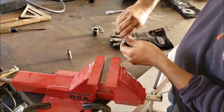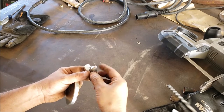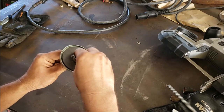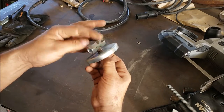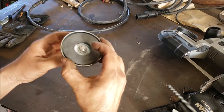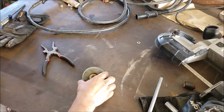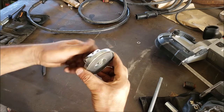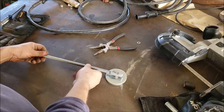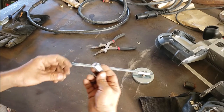We're gonna assemble this — put a washer on the top side and another washer on the bottom, put the nut on there and get it snug so it doesn't wobble as much. We're gonna give it a quick tack — just something small like that will hold and keep this nice and snug with no wobble. Now we're gonna put this rod in here and another one here in the front.